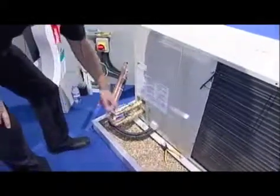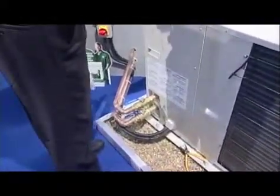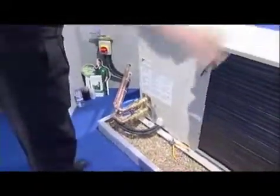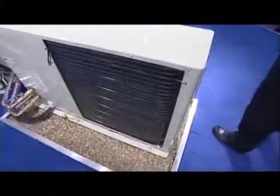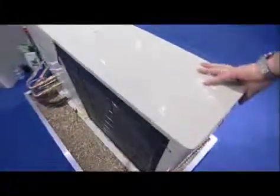You can see there are two isolation valves built into the product, just for replacement or drain down if there was a problem. The actual foundation that you put the unit on has to be specifically designed to ensure that the unit can drain during the day — it will periodically go through a defrost. The air contains moisture, it freezes across the evaporator, and we have to create a rain drain or soak away.